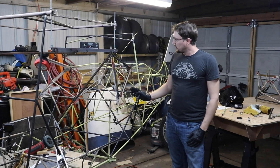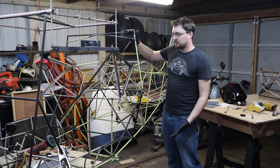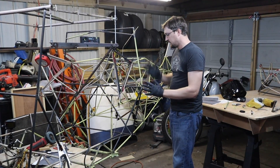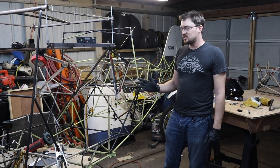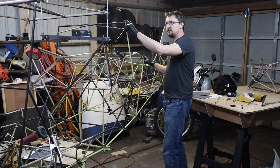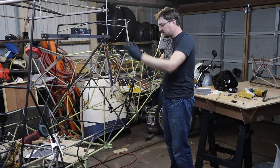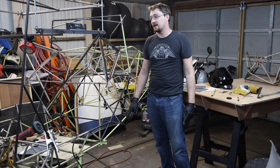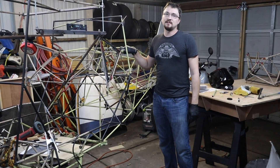And that's our former in place. It's only tack welded for right now in the center here, but we'll go ahead and finish that a little later. This will give you a really good idea of what I've been talking about. Now we've got this truss coming back here, we've got a brace coming up and holding this guy right here. This is replacing the original one right here, so we're going to be sitting the whole way back up against this, giving us more room and getting that CG where we want it. We still need to put the metal going from back here up to this and up to the birdcage structure, and we have to do that before we can cut this center section out. If we cut it out right now, the only piece holding the fuselage together would be the bottom long run and the entire fuselage would turn into a banana. So we've left it for now, we'll get those pieces in, and then we can take out the center section and see what this thing's going to look like.